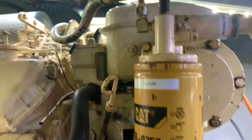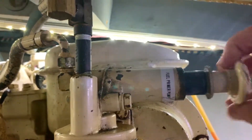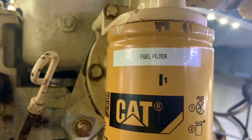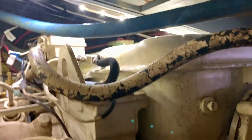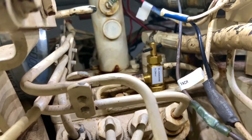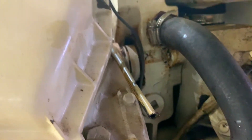This is our fuel filter and a primer that unscrews so we can pump it to prime in case we lose prime on the fuel. This is our vacuum gauge and our fuel filter. This blue line here comes from the fuel tank and goes through the primer and back out into the fuel block. On top of the fuel block is a bleeder valve with a little hose that comes out that you can put a bucket under in case you lose vacuum on the engine.